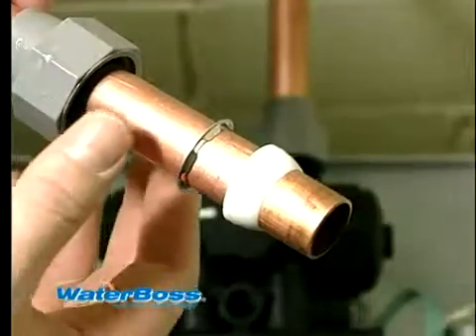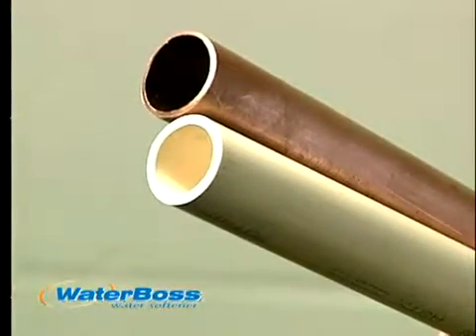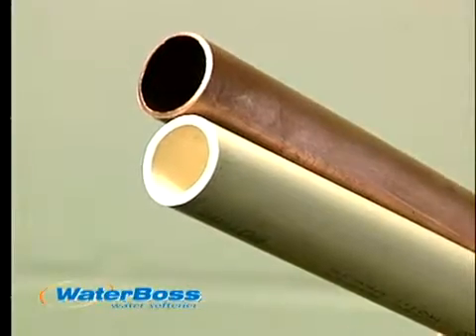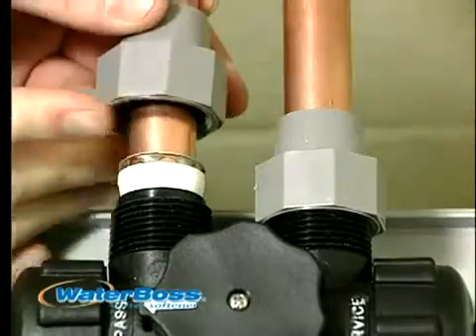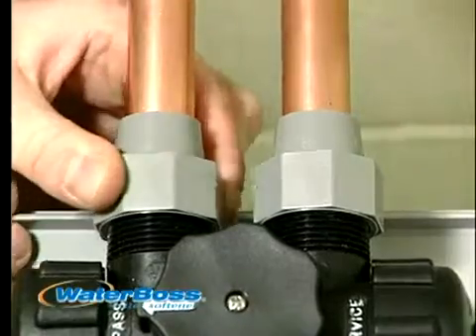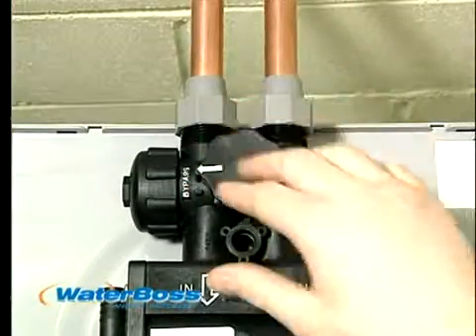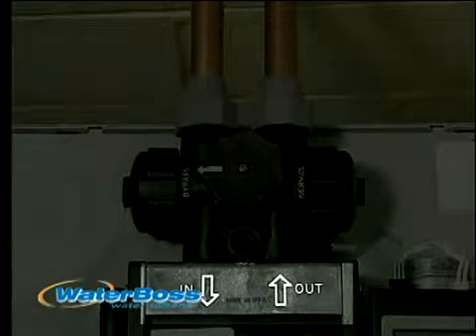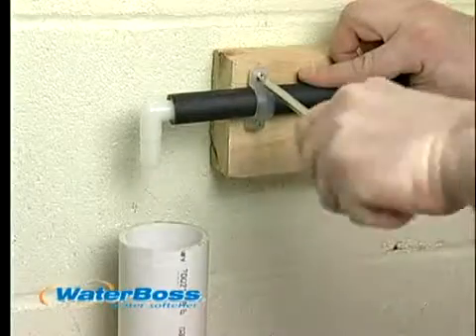The Quest fittings provide a convenient, easy-to-use three-piece assembly for 3/4-inch copper plumbing or 3/4-inch CPVC plastic tubing. Make sure that the nylon sleeve, metal retaining ring, and collar are correctly installed in sequence on the pipe as shown. Do not over-tighten these fittings. Place your valve in the bypass position and check the arrows on the inlet-outlet adapter — be sure that water flows in the correct direction.